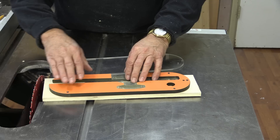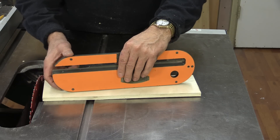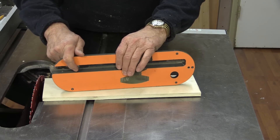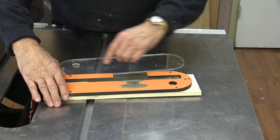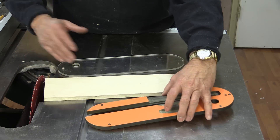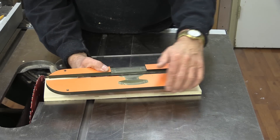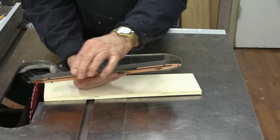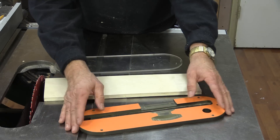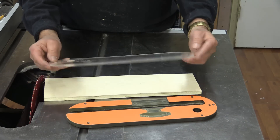The first throat plates I made, I made them on the router using a templating bit. What I discovered was — see how when I put a little bit of pressure on there, it moves down a little? I found that when I was making inserts with templates, they were a little bit on the loose side. Instead of using the original insert as my template, I didn't want to risk hitting it with a router blade and destroying it — and sometimes these are metal. That's another reason why you might want to make a plastic template.